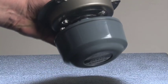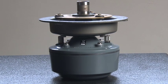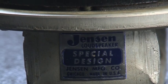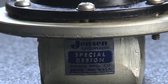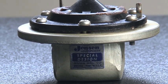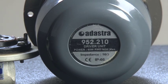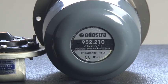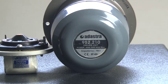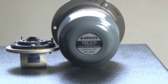Recently I've come across these drivers and they're incredibly cheap. They are marketed under the name Adastra — 60 watts RMS handling and 16 ohms. They have a frequency response up to 7k then you get a severe roll off. That's not a problem because one of the main issues I've had with drivers other than the Jensen V21s is that the bandwidth is too good and the organ sounds scratchy and brittle at the top end. These Adastras are quite mellow, and trying it with a Hammond XK3 I was surprised that it got rid of almost entirely the screechiness of the instrument. I'm not going to use these in the Leslies I'm building for the studio — I'll use V21s — but they're worth considering for live use.